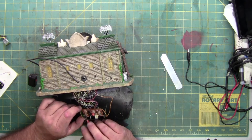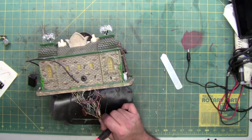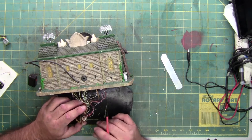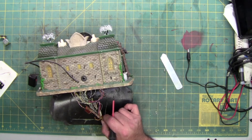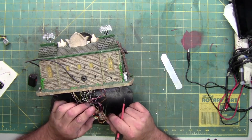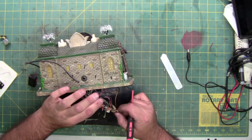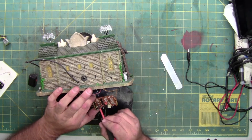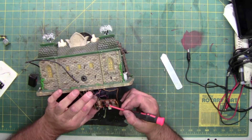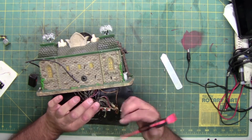There's a lot of glue on this board from where they hot glued it. I believe this uses the standard transistors that Lemax is known for — yep, C1815s. They use the same transistors on most of their houses that don't have any animated parts, to have the lights flash back and forth in a pattern. There are four of them in a row — it's a very standard setup for Lemax. The Lost Souls Prison is another piece that uses this same section. These are standard transistors, so if you blow one you can buy a bag of them — they usually come in packs of 10.